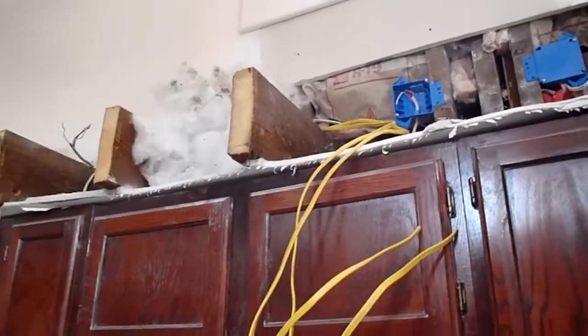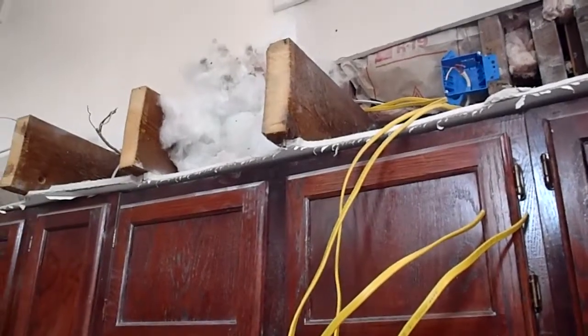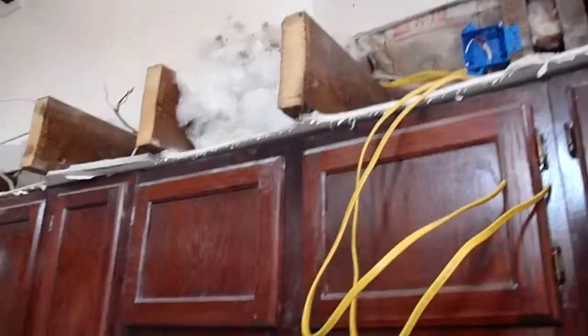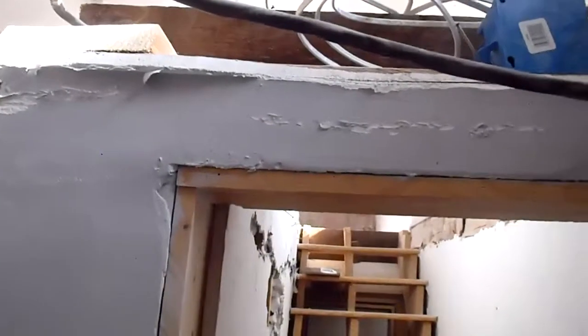And I had somebody else check it for me just to make sure, but 12 gauge is more than adequate wire for it. I would have never believed it, considering the size of the cable they've got going to the stove top, but that's a different situation. You can see it right here. This is the cable they've got going to the stove top. I'm not sure what that is, maybe 8 gauge. But 12 gauge meets the requirement for the oven.